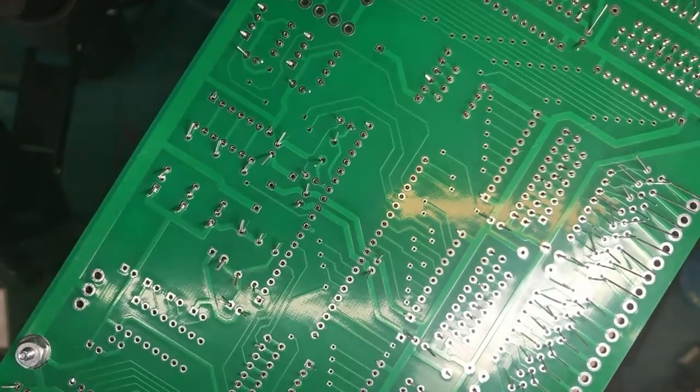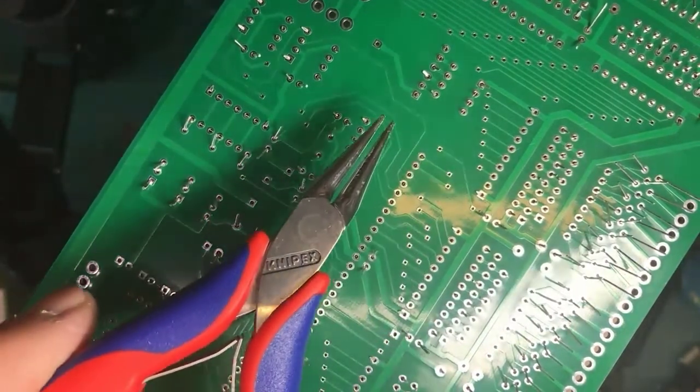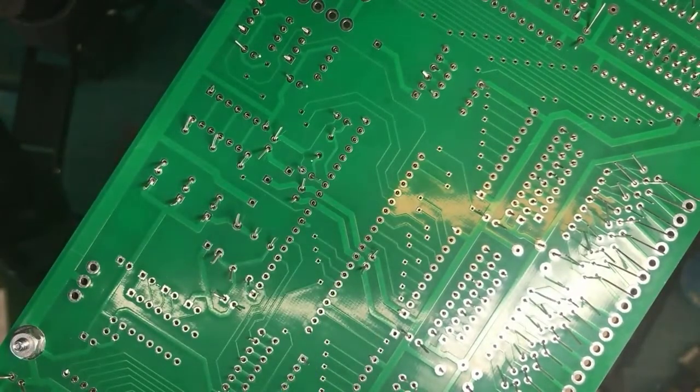In this case, what I'm using is a fine round nose pliers, and a tinned lead makes it much, much easier to get leads to behave when you're doing fine work. In a circuit board where the lead's coming through the hole, you could tin it, yes, but what I'm more concerned about, frankly, when I've got a lead in a hole that's too big, is trying to figure some way to keep it still while I'm working. If you tin it to make it fatter, that might help. But better is, in any soldering, that things do not move while you're working.